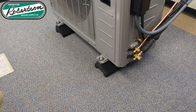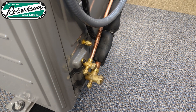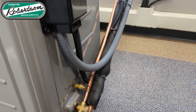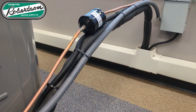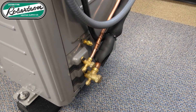As you can see in our lab install here, we have them mounted on blocks. Direct mounting to the pad is possible, however not recommended as it is a heat pump. Here we can see the outdoor liquid and suction port connections. We have an uninsulated liquid line as well as an insulated suction line, just like a normal heat pump. This does use liquid line filter dryers, as you can see here — much like standard unitary equipment.